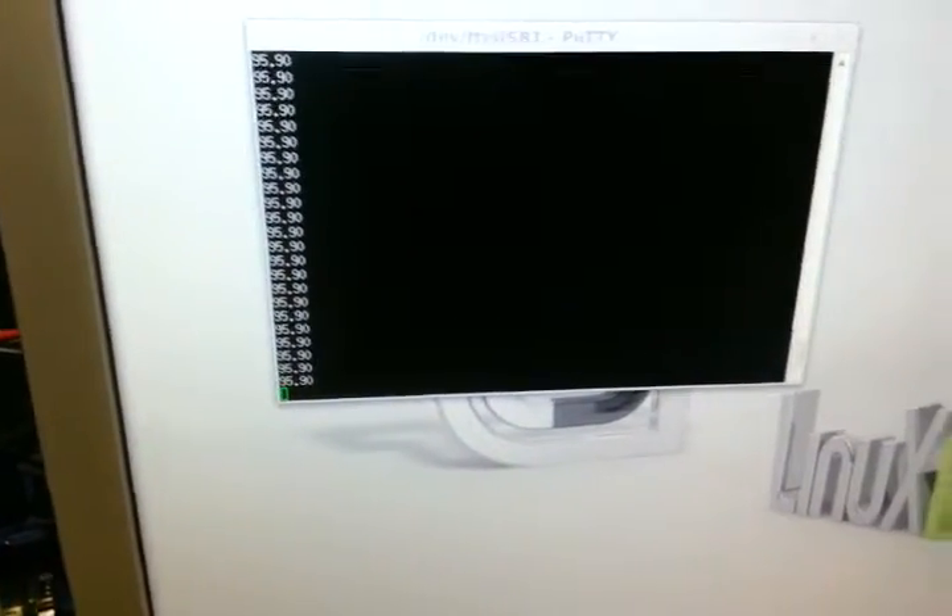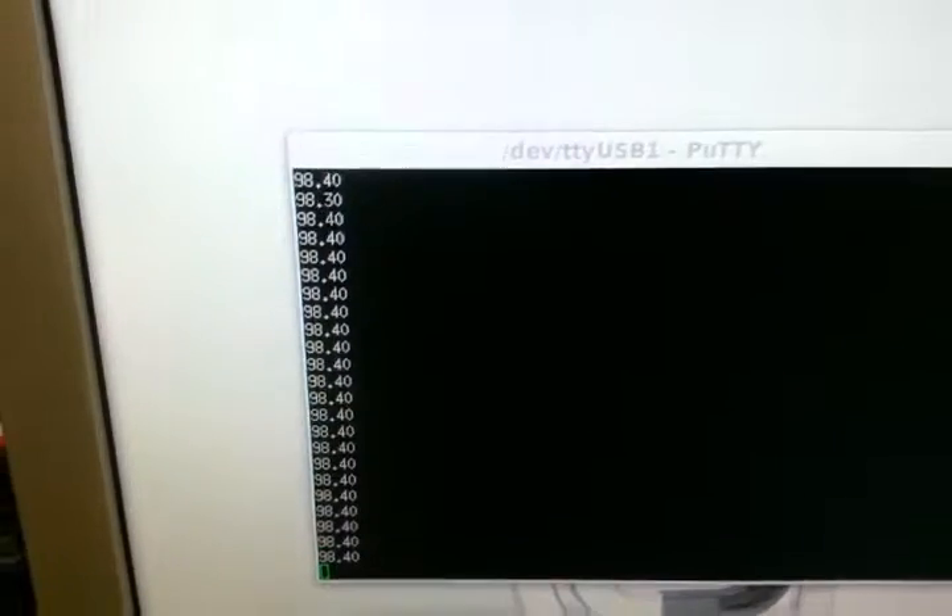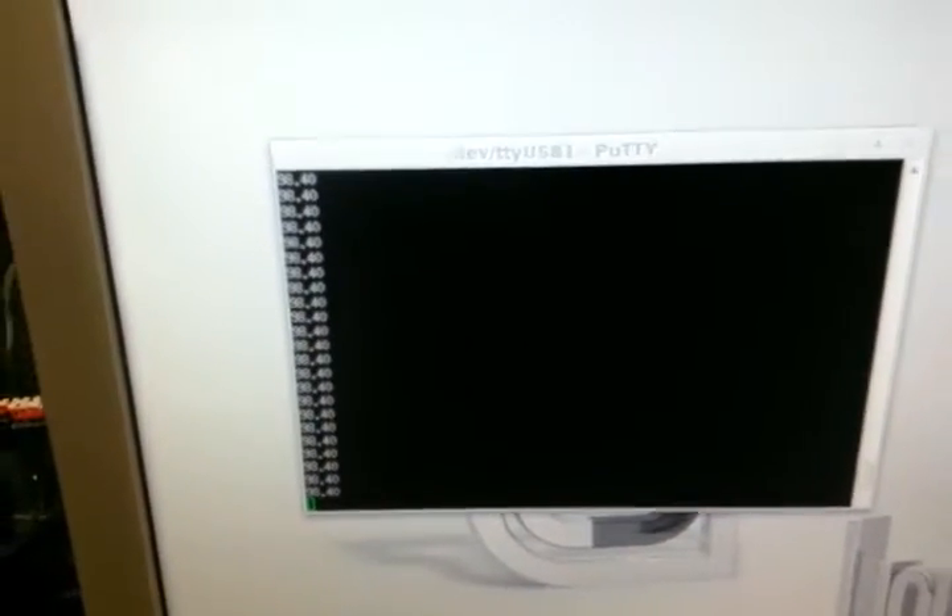Here is my terminal window. It is actually using the terminal to communicate what channel it is on. One thing I dislike about this is how touchy it is. In the code there is also an issue where you are tuning to 0.1 of the frequency. You can see it is sitting at 90.4 MHz, but FM actually has 200 kHz of bandwidth between channels, so there is no 0.4. That is why FM 96 is actually 95.9 — the next channel up would be 96.1.